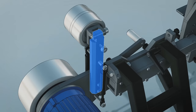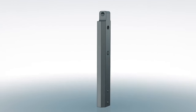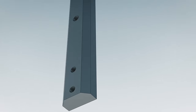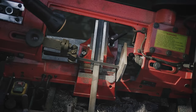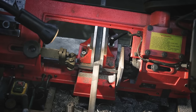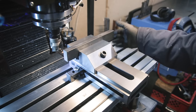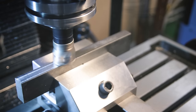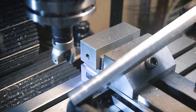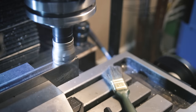The next part is this long column which slides up and down in that slot you just saw, and it's the main part for the belt tracking and belt tension mechanism. As with most of these parts, I'm starting with some raw hot-rolled steel again. The stuff is usually not really dimensionally accurate or even straight, but since I'm facing all the sides anyway it doesn't really matter - I bought the stock material oversized so I have enough material to work with when I take it down to final dimensions.